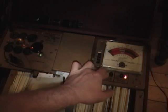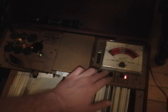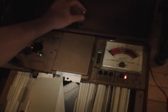All right, this one's looking more promising. No shorts, no secondary emission. All right, nice and strong. I should have checked the gas too. No gas. I don't think I've ever actually found a tube that was gassy, other than ones that had completely lost their vacuum and the getter had gone all white. But it doesn't hurt to check. All right, both sections of this tube test really good, so definitely go with this 6AV6.